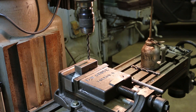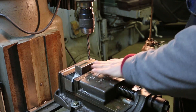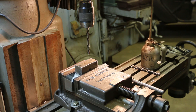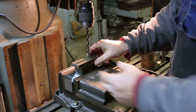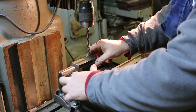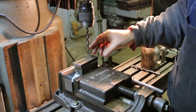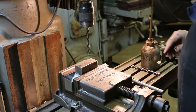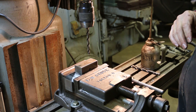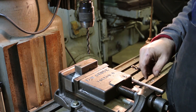Now that we've got all the holes drilled and tapped for the half-inch stops — the two in the arms and the one in the body — I want to go ahead and drill and tap a hole in the bottom that will be for the clamp. There will be a piece that will basically clamp onto the bottom here, a 6-inch by half-inch piece that goes up underneath the lip of the V-way. We're going to have a hole and then probably a pin to help index it and keep it from flopping around. I decided to go with a 7/16-inch, 14 threads per inch bolt. We've got a letter U drill bit in here and we're going to drill that out and tap the hole.